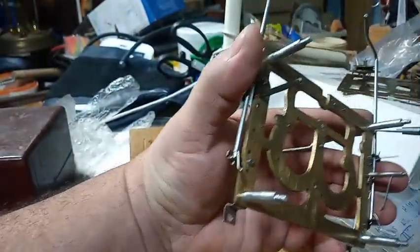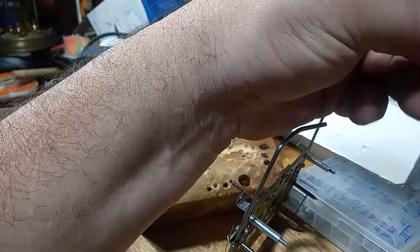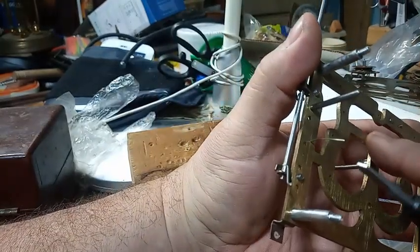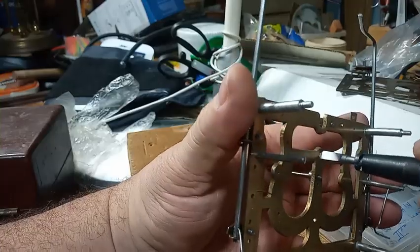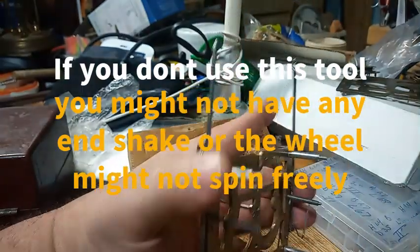I'm through the hole with my reamer number 2. So now I want to put the chamfering tool on. That will take care of the burrs. Believe it or not, you could peel a burr here. So just a couple of spins to take care of the burrs. Now it's nice and flat.